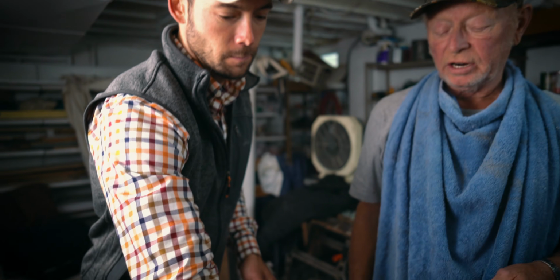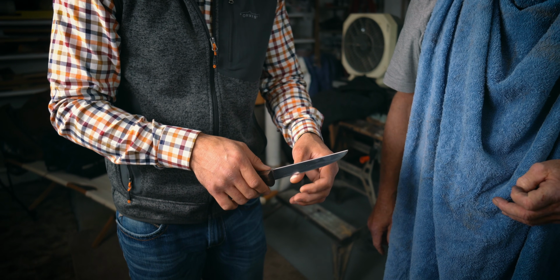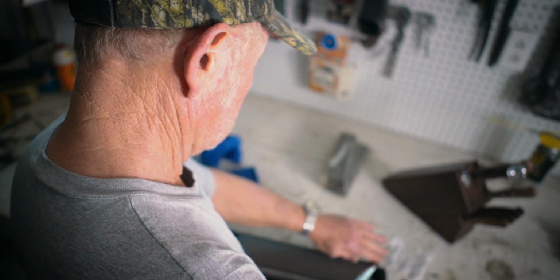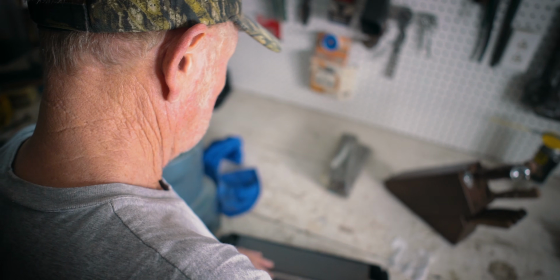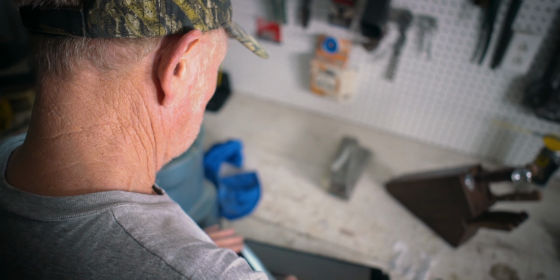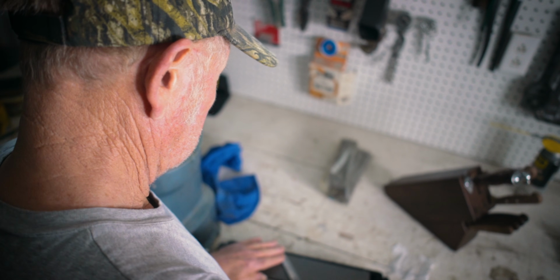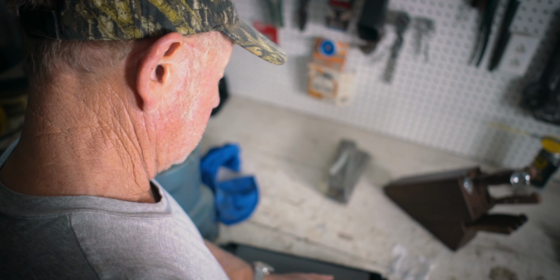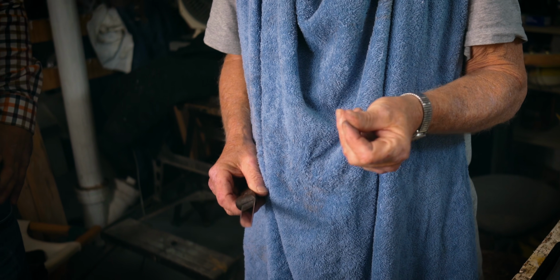Now try that, and that I just had a few strokes on. And it catches on you. It drags because it's cutting in. So you use just barely your fingertips and you can feel whether it's sharp or whether it's slick. Yeah, like up here at the point, it's slick still. But I've run my fingers, when I'm all said and done, I've got a lot of little cut spots on my fingers, because when it's sharp, it will dig into your skin and make a scratch, actually.